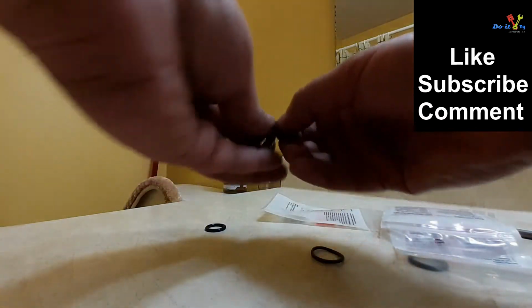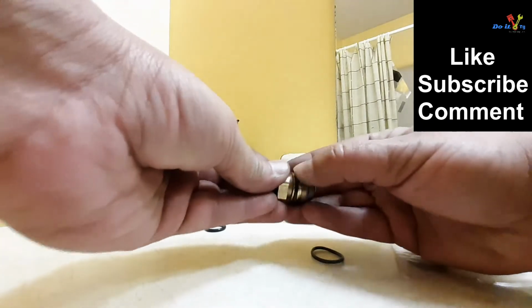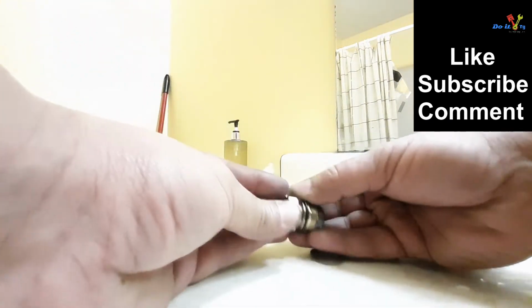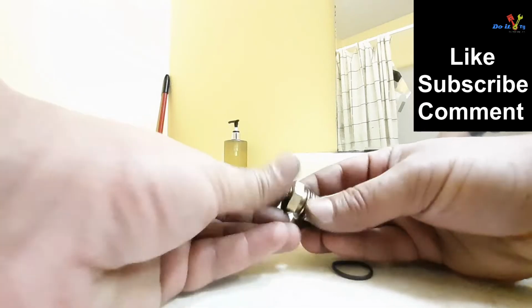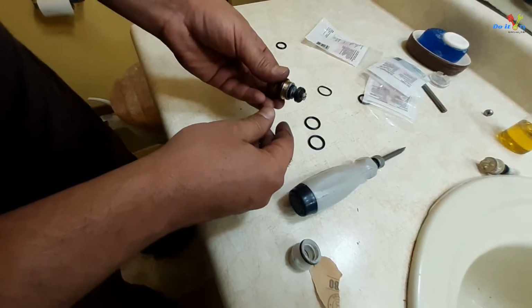The O-ring and washer are easily available at a hardware store. Just take the old ones to the store and make sure to buy the identical ones. You can also replace the whole cartridge that comes with O-ring and washer pre-installed.